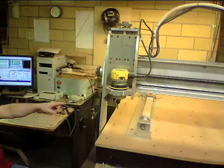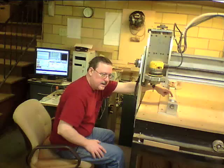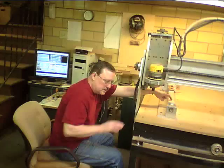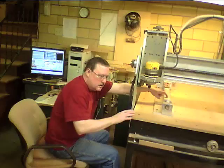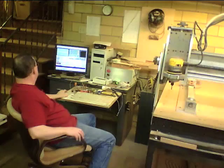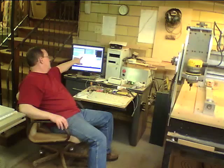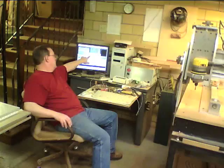Then you have coordinates for the various fixtures that you have on. So for the neck, zero is right at the plane at the top of the neck where the fingerboard meets, at the middle of the 12th fret. So zero, zero, zero — X, Y, Z. And you have a chart, so like G55, which is a code that the machine reads, is offset 158.52, 303.41, 58.89, 8.9.